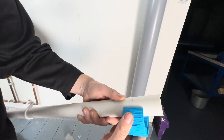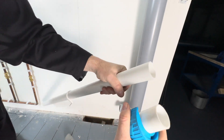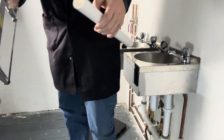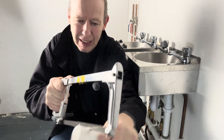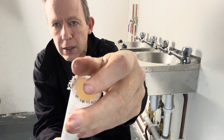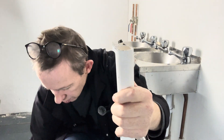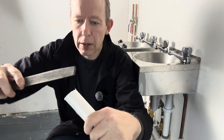Using the 40mm pipe cutter, following the arrows, no filing is needed with these modern methods. If you haven't got one of these and you cut your pipe using a hacksaw, you need to make sure you remove all the burrs — because if you don't, when you push the fitting on you could split the inside. So file it down, both outside and inside.